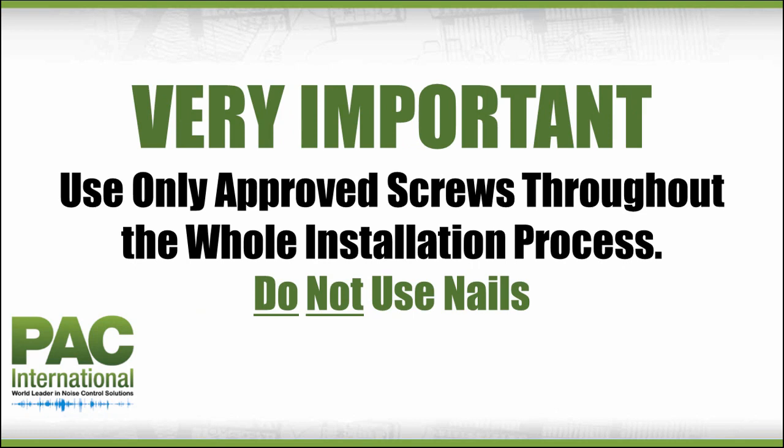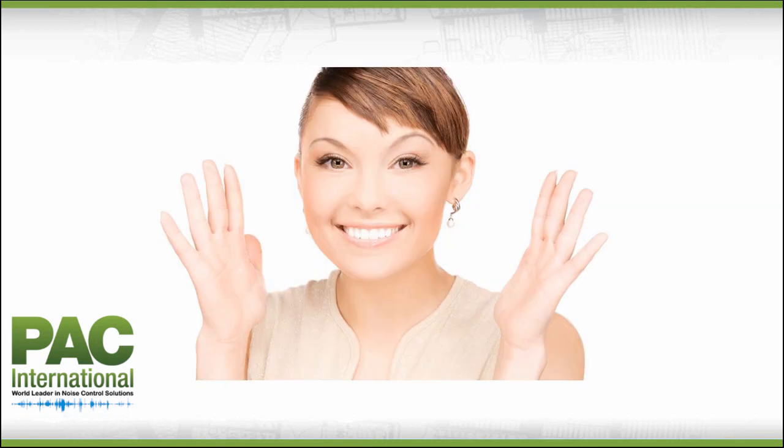Very important, it's worth repeating again, use only approved screws throughout the whole installation process. Do not use nails. Problem solved. When installed properly, the resilient sound isolation clip shown will virtually eliminate all vibration and noise.